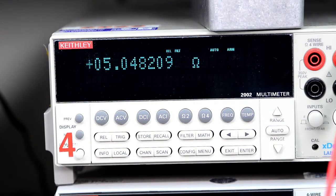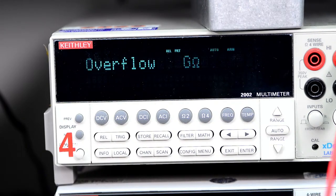So the other end, 5.048, and here 5. You know, because the actual resistance across the whole trim pot on the old one we have 10.5505, and the new one we have a smaller value. So yeah, the ratio isn't the same. I guess we need to adjust it slightly lower to get a similar result.